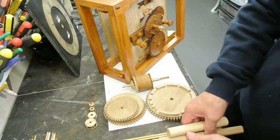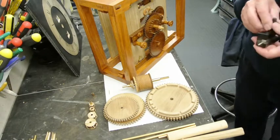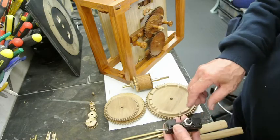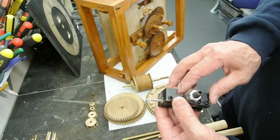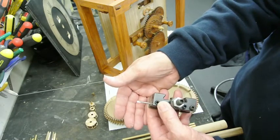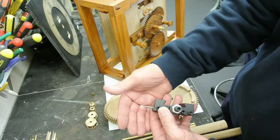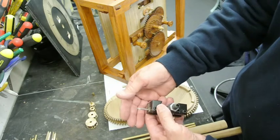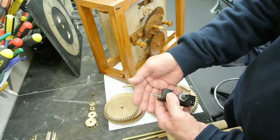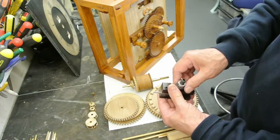If you want to turn oak, a tip from me is that the best way to turn it in the lathe is to use these very sharp carbide bits that are used for boring, and I use them both for boring and for facing. It's difficult to know whether you can see that. Oh, it's in focus. They're incredibly shiny and sharp. They're very, very good for turning wood and metals, but they're very springy. But in wood it doesn't matter at all, because they're quite thin. And they're from Banggood, and they're easily the best of these small turning tools that you can buy anywhere. I'm very glad to an Australian chappie who had reviewed these. I've used them, and I say, use them for turning as well as for boring, in wood at any rate.